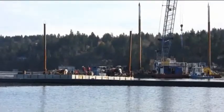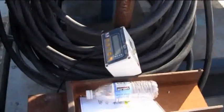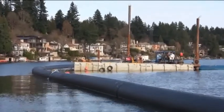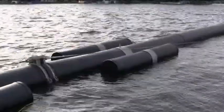A 40-foot by 10-foot barge mechanically pulls the flexible pipe into shape using winches. When the pipe has relaxed into the required curve, internodal cables are attached to the pipe to keep the curve intact. The barge then moves to the opposite side of the pipe and repeats the process until the S-curve is complete for the entire pipe length.